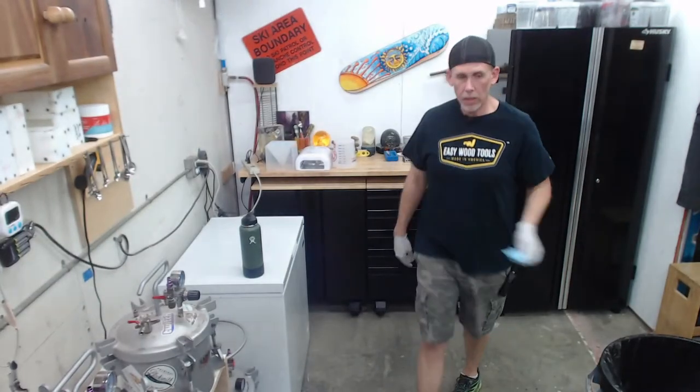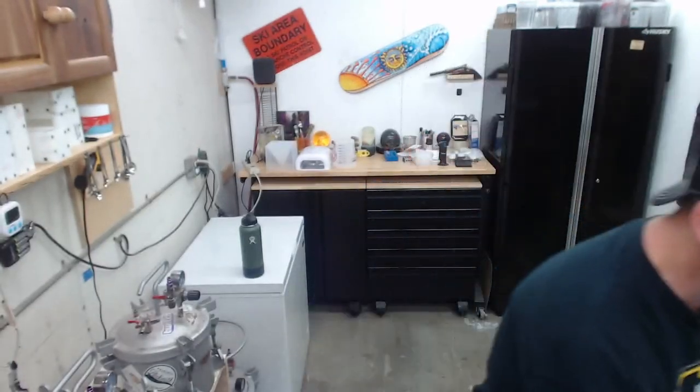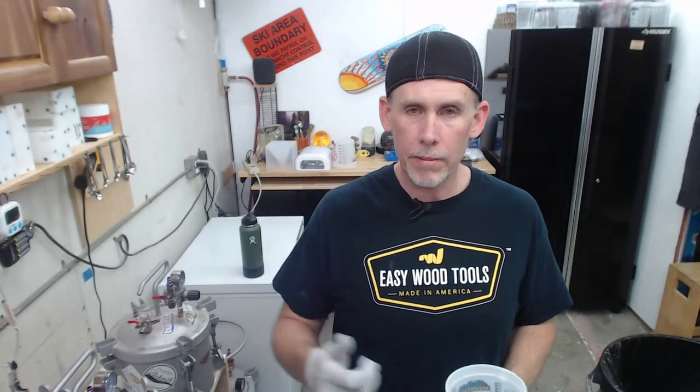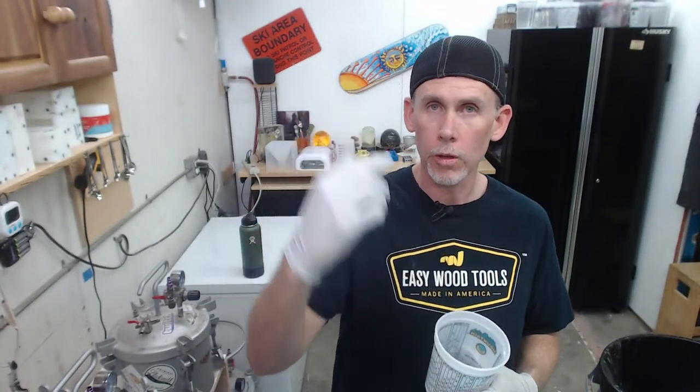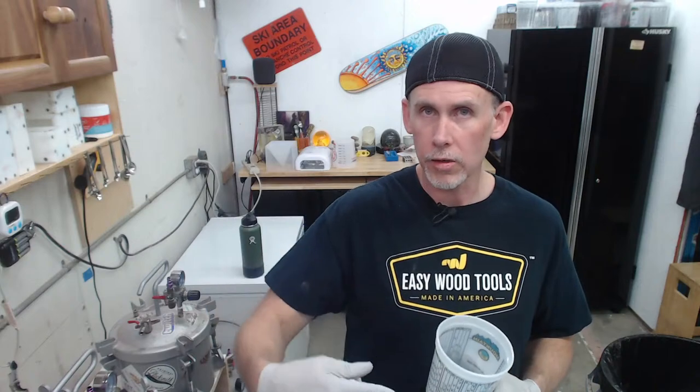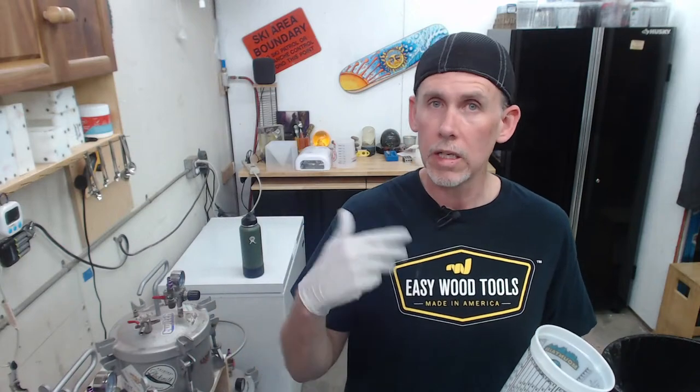And one other thing to think about also is, I may say I poured it at like 110. Well, usually the way that I measure the temperature is I stir up the cup first, then hit it with the gun. I don't just let it sit on the desk forever without touching it and hit it with the gun, because the top level is going to be a different temperature. It's going to be cooler than the center. That's why I stir it up. And so whatever way you do it, you need to do it the same.